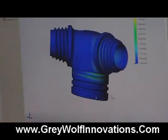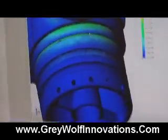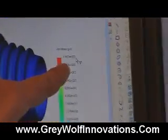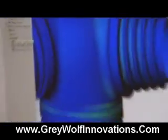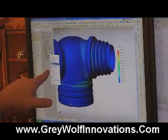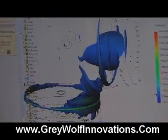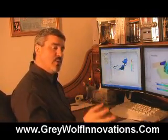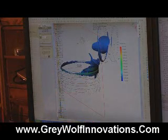After we get done, we can see what the net effect is on that part. What this is showing is the von Mises stresses — basically the concentration of stresses in the part. All this is showing right now is just the outside surfaces, but we can see that we go up to 6 times 10 to the 3rd power. To really get an understanding of what's going on in this part, we need to dive inside it a little bit. The way we can do that is by doing something called isoclipping, which allows us to take away the lower stresses and see where we have our highest concentration — basically peer into the part and see where the highest concentration of force would be. These are the areas that would weaken or fail first, and right here pulling up on it, we see an increased concentration of stresses.